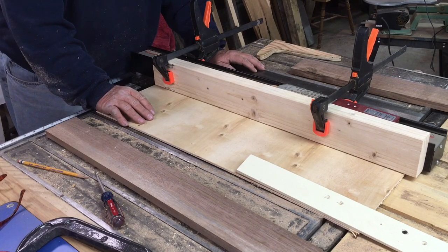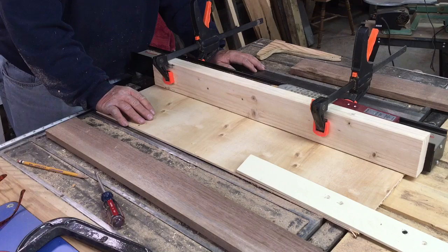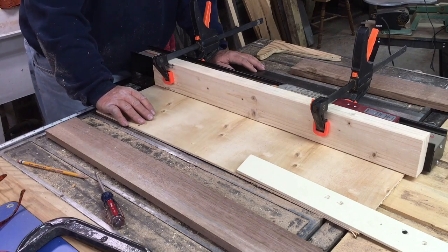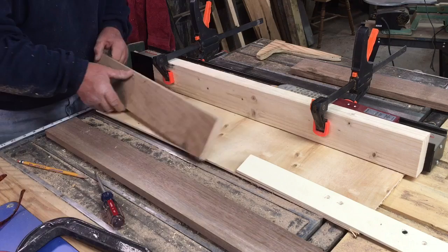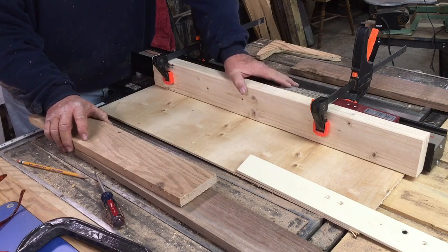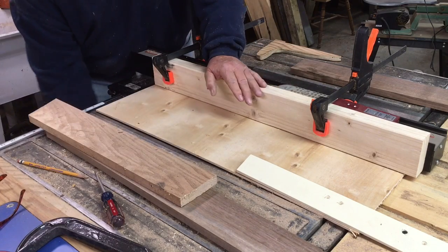The next thing for me to do is to slowly bring my cutters up through this plywood, because I only want to bring enough up so that I can run a first pass with a sacrificial board to make sure I've got this set up right. I've got a board here that I can run as my sacrificial board.